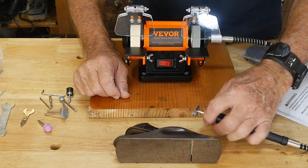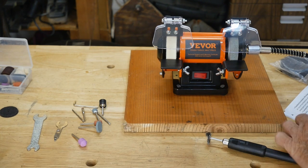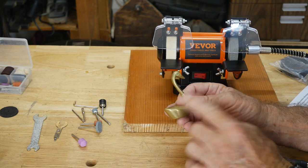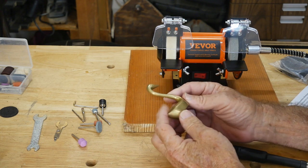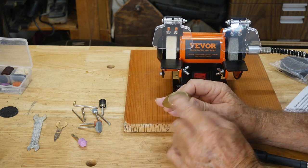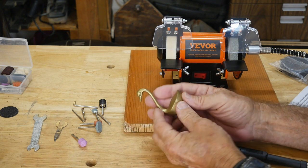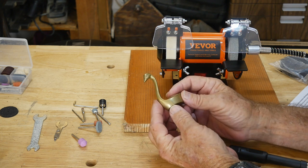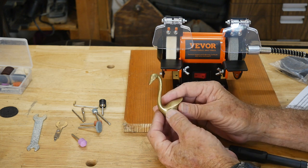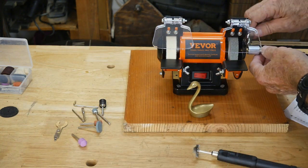The wife's got some brass around, maybe we can find a piece to deal with. Quick word about buffing — the problem is these things are sometimes just paint over a cheap piece of pot metal, so you're best to try buffing underneath or somewhere hidden. Otherwise you could destroy the whole piece. In this case it looks like brass but I'm already thinking this is probably just paint over metal.